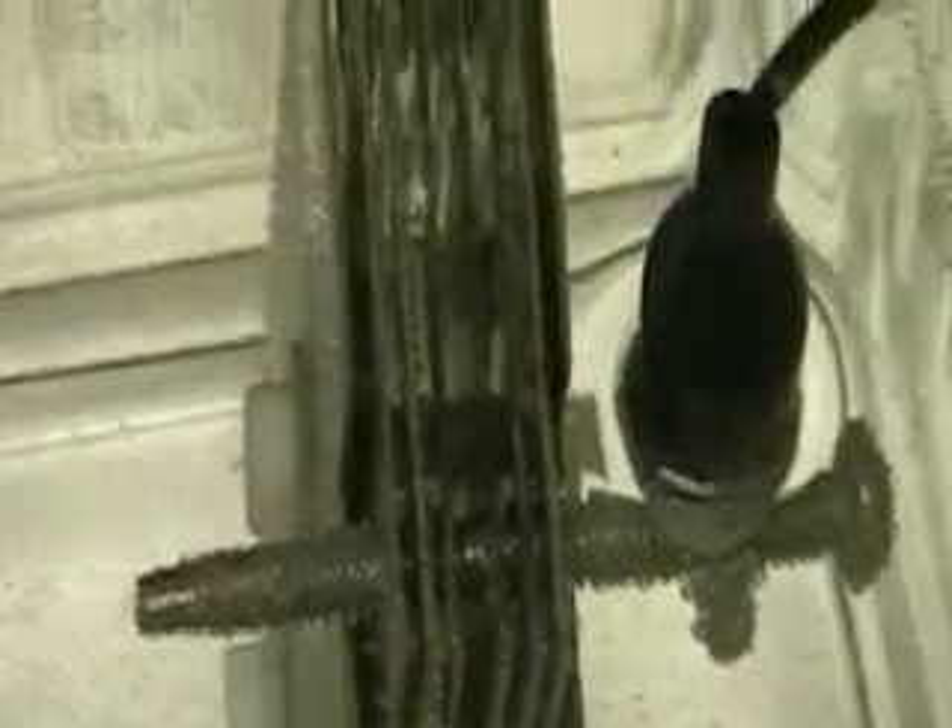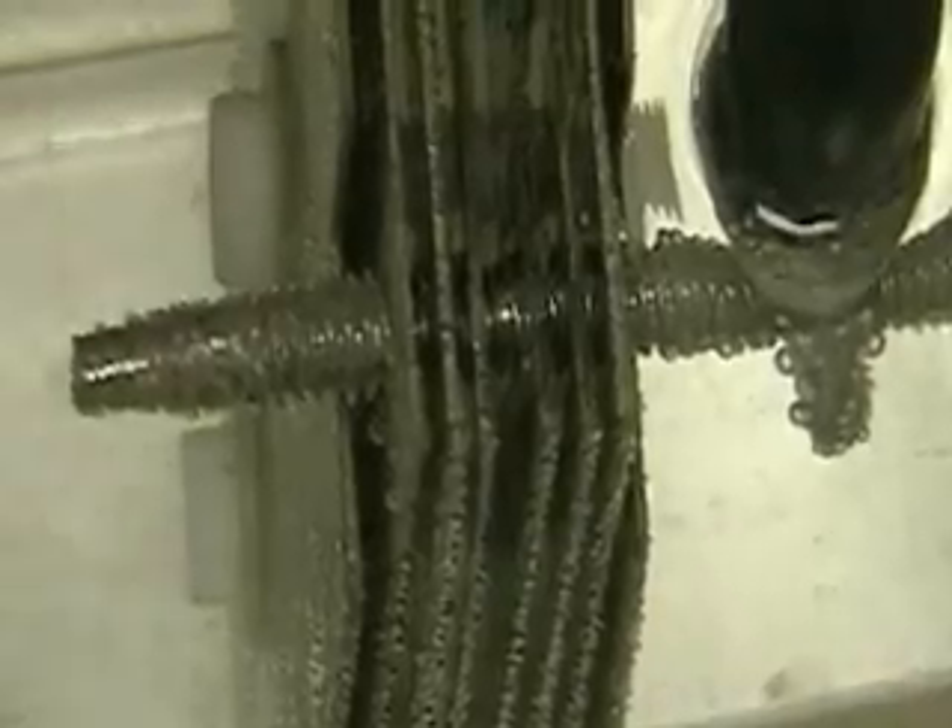Right now what I'm using is six plates positive. Notice — as you look, there will be six plates positive here and two plates negative on each end. The ends will have negative and the center will be positive. Interesting results, and I'll show you what that looks like.